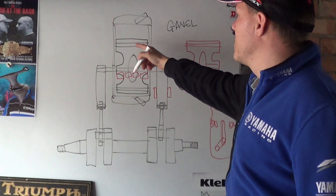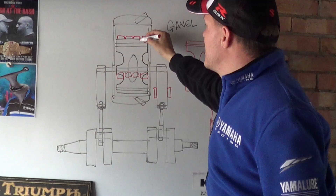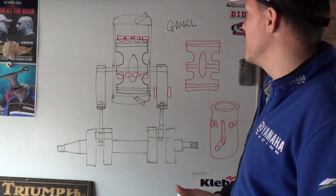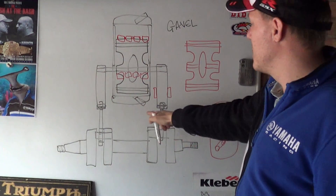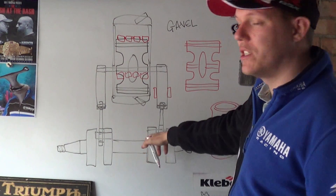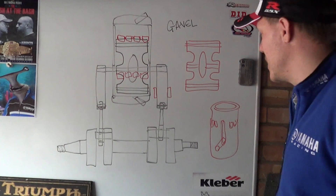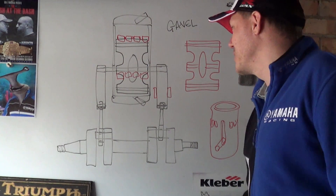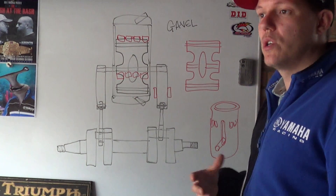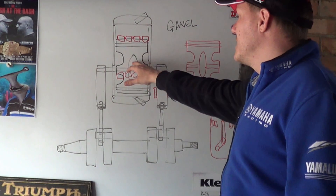Also when you come down to here, you open up your ports like so, so this fuel and air mixture can then travel into the cylinder. It does require direct injection and spark plugs. It does get a bit iffy down here and you start to run out of room, but you could use the crankcase section. You might look at this and go, well hang about, there's some serious complexity here - and I totally believe you on that. The piston would weigh the same as two pistons in a sense.